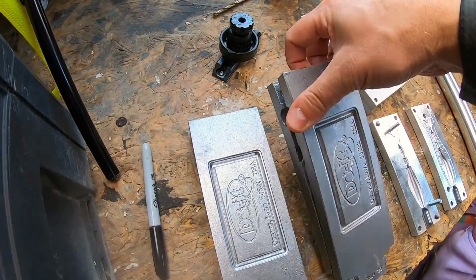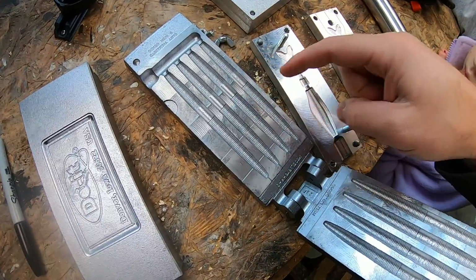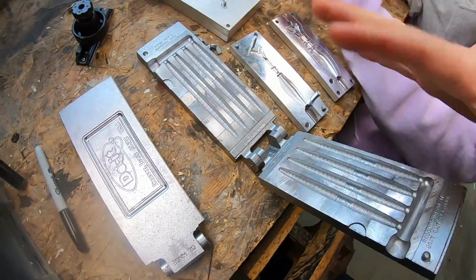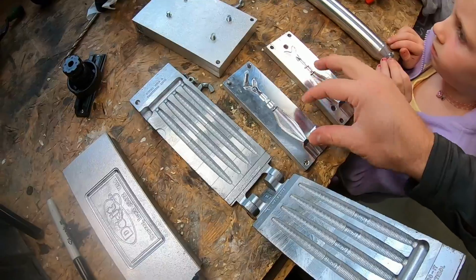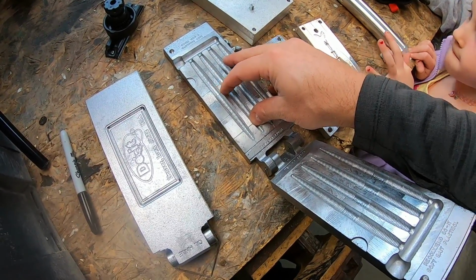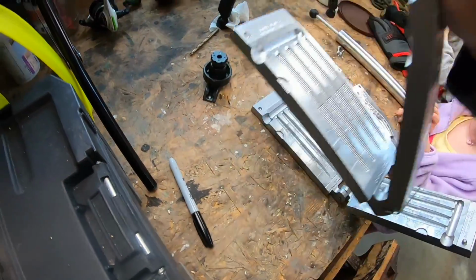And these are some of the most inexpensive worm molds you can get. So these are the lead molds. These are actually the Yamamoto Senko molds, the exact molds, except for there's a little Do-It sign on these ones. And these are going to be a lot cheaper than your aluminum molds, right? This is going to be like $50 to get this mold. Your aluminum molds are going to be almost 3 times as much. And the reason that they're 3 times as much is that they're going to create that shiny gloss kind of look that a lot of the baits will have. The lead mold is going to have this matte look, which I actually kind of prefer on my worms. I don't think the bass care. And so I like saving money where I can. And so this is the exact same one over here.